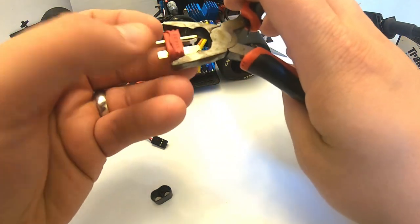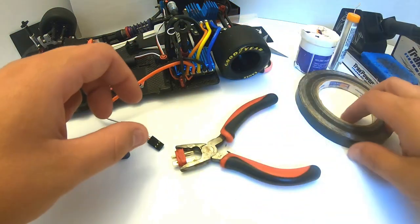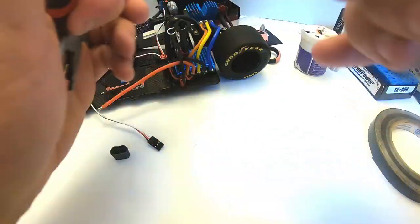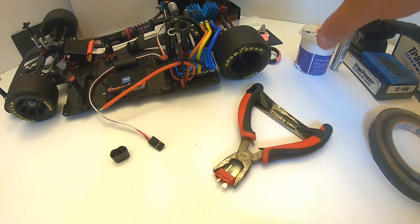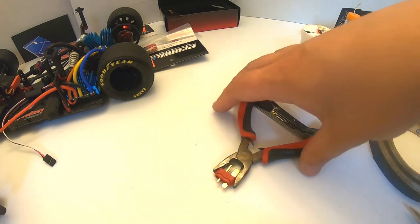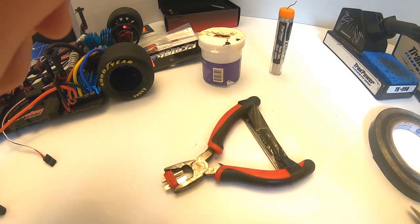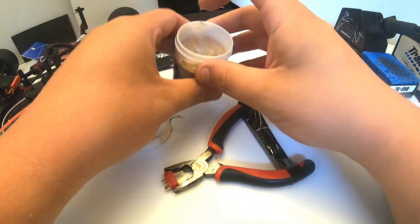What I'm going to do is use my plier method — I'll hold the connector and tape the plier handles together. It may seem a little silly, but it's a method I've used for years. Now, let's talk soldering temperature. If you go on Google and look up the proper soldering temperature, most things will say 300 to 500 degrees Fahrenheit. I'm in the 500 and sometimes even higher degrees Fahrenheit camp — I'm usually running about 700 on my soldering iron. That may be because it's a little older.